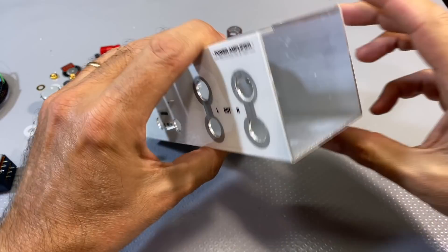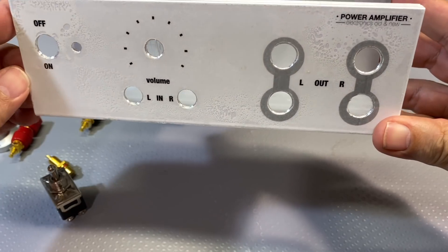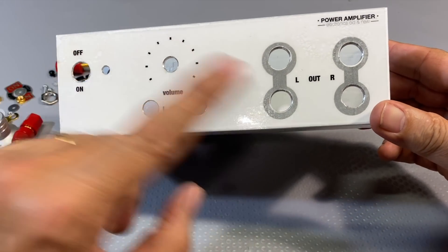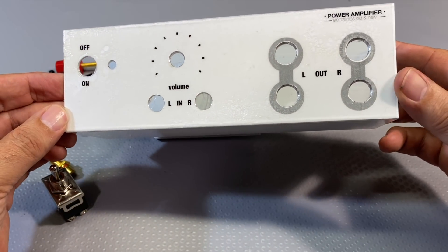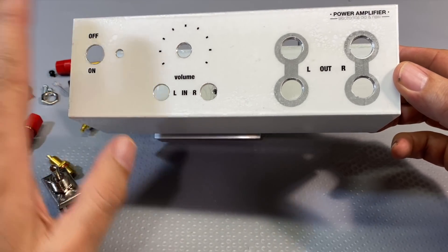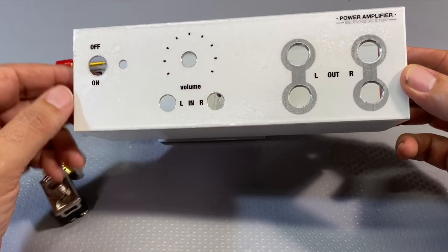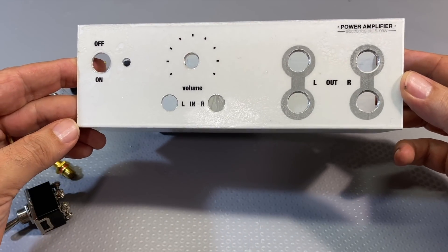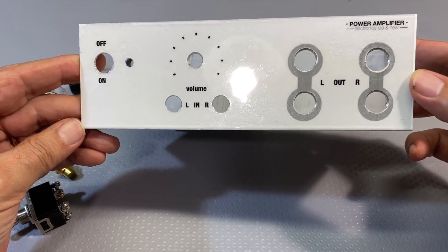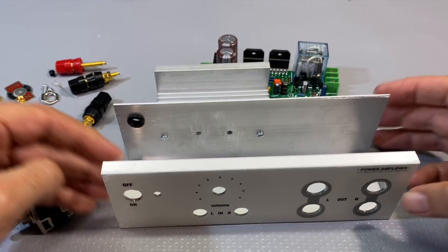This again is one of those aluminium profiles cut at the top and it's going to fit the back there and look pretty cool. I've drawn out the faceplate on Adobe Illustrator, printed it out on a transparency, and with some spray glue I cut it out and glued it to the front. Then of course sprayed some lacquer just to make sure everything stays. That's how I've done it with the other ones. I did attempt something with decals but honestly this is just a lot simpler for what I need.